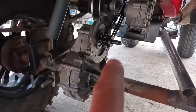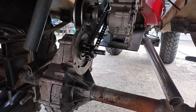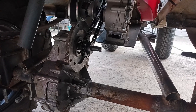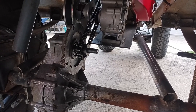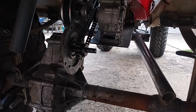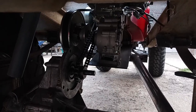I ended up taking that shaft right there up to the machine shop and having it balanced, because I had to take the spline off the original engine that went into the rear axle. I had to hook a five-eighths regular jackshaft section to that spline because I wasn't able to get the whole thing out of the original electric golf cart engine. But anyway, that's all hooked up.